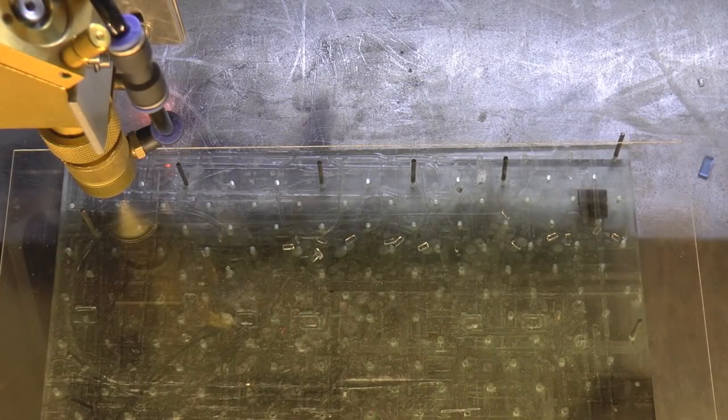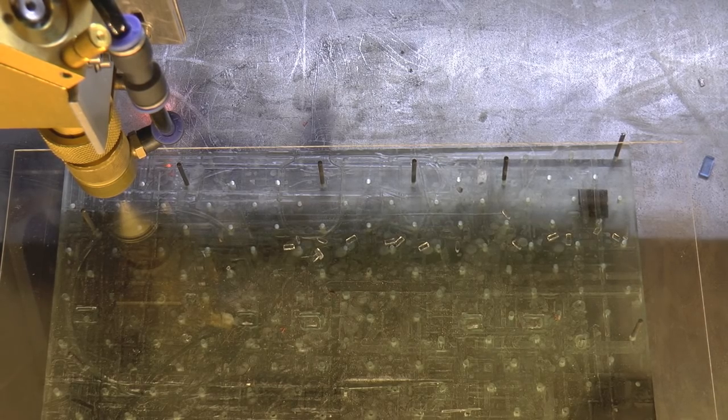Okay, now my second test is to test for something completely different. I will explain what I'm doing with this test when we get to do the measurement side of it. Now, I'm running this test at various speeds. They're all with 65% power, which is quite high cutting power. And I'm running them at 15, 20, 25, 30, and 35 millimeters per second.